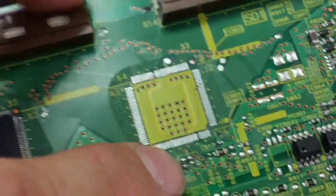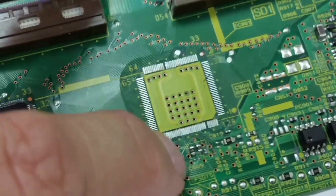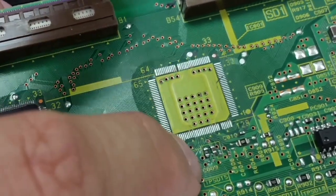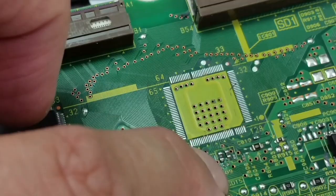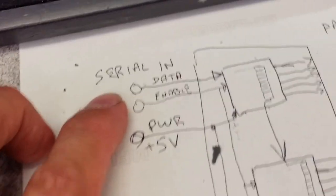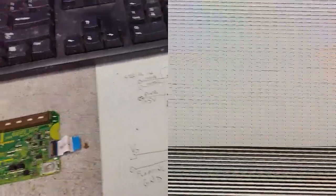So we came to here, removed the IC, and the short was still there. And it is still there because the 5 volts, in addition to going to that filter cap and to the power of the IC, go through this small jumper, 0 ohms, and go to another pin of the IC, and from the bottom through that hole here next to the 0 ohm resistor, they go also to all the other ICs. So there is another line in this case, which takes the 5 volts and sends it everywhere. It's not power, it's probably some configuration that does all that.